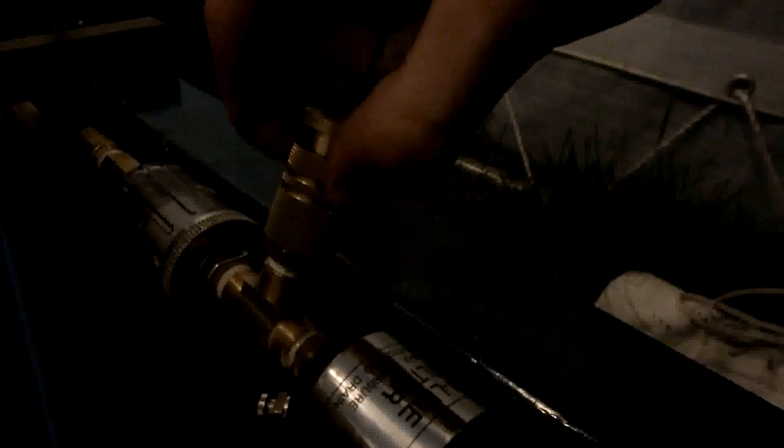The white collar in there has a very specific filter size that blocks out water and oil and everything, and it gets contained in the jar here, and then every once in a while you drain it out. Then I have a quick connect, a T, and then a female coupler M-type air hose connection. So then with this, you can plug in an M-type plug, and you can use air tools off of it.